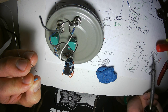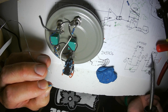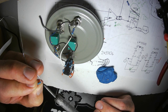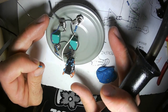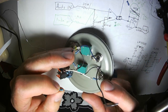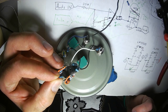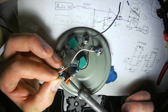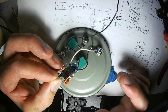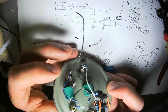But if you connect this output to a positive voltage, like straight to the positive rail, and it's trying its very hardest to output the negative rail voltage, you're probably looking at a burned up op amp. So 100 ohms resistance, 200, 300, 680 ohm resistance is probably a good idea. Go ahead and include that in there.